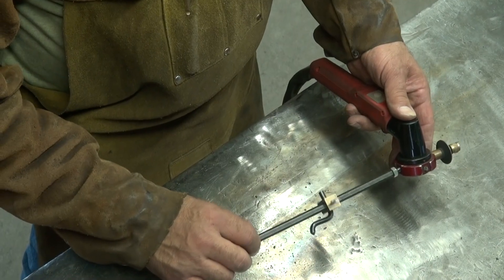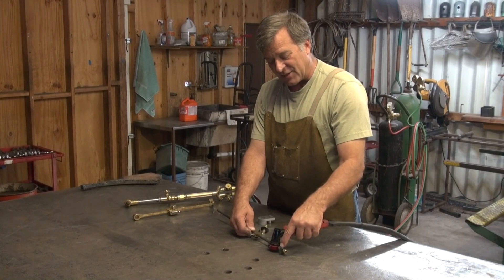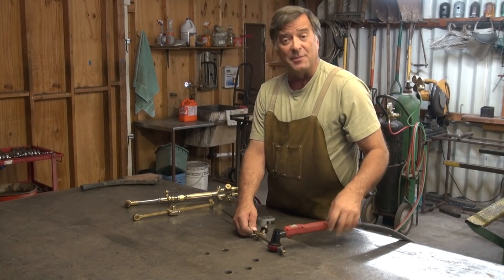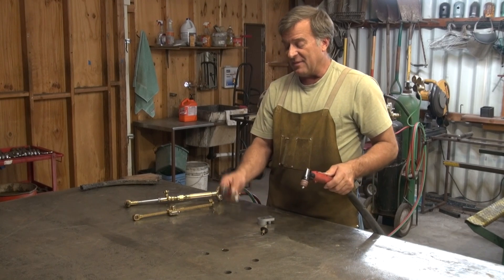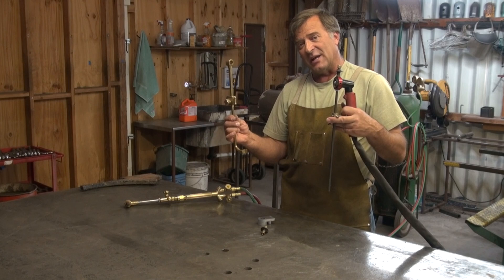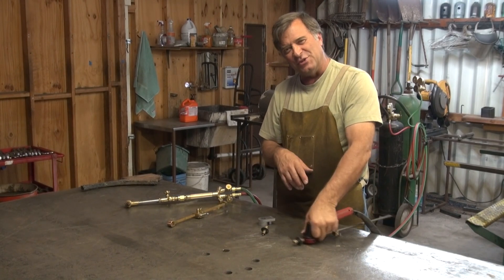The circle attachment would just screw in where the wheels would normally fit. This one's kind of cool in that you've got the little training wheel on the little adapter ring on your plasma torch or on your oxygen acetylene torch, to help get some of the wiggle out — any kind of little shake on it — so you get a nice smooth curve. But you've got this darn rod sticking out everywhere, and even if you put it on the same as this would fit on the oxygen acetylene torch, there's nothing supporting it back in here, so it's a little wiggly and not quite as smooth as you would think.